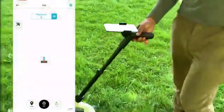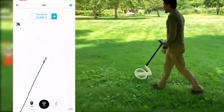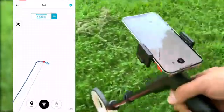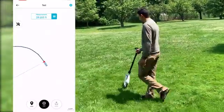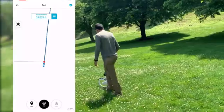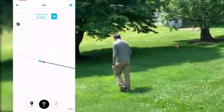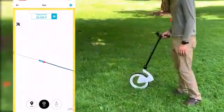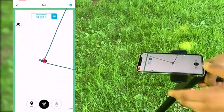Now that I'm connected, I can start walking to my first point. So if I have a known starting point, I'm going to begin to walk to this first cone. Once I get to this cone, I'm going to mark the point, turn, and continue walking my path. I can draw any kind of shape I want, put a couple loops in, mark another point, and continue walking. It'll start to beep as I begin to approach my known starting point, and once I reach that point, I'm going to have a solid beep with a green light. Then I can select Stop.